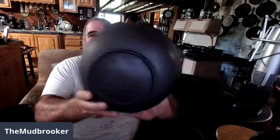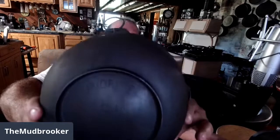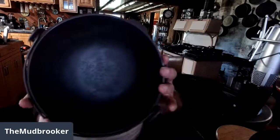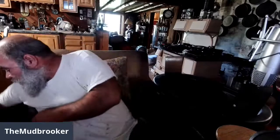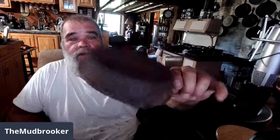That Favorite Ware scotch bowl I showed a couple of weeks ago — this is what it looks like out of the lye. It's got a block logo that reads 'Favorite,' it's a number three, probably three-quart, with a ring on it and a bale on top. That cleaned up really well. I'll give it a little trip through electrolysis to get a bit of rust off the inside — I run everything through electrolysis after stripping in the lye anyway. It's really going to be nice when I'm done.